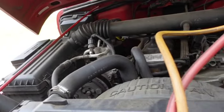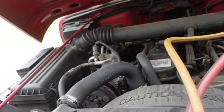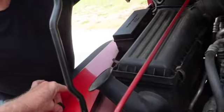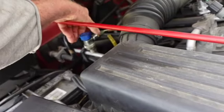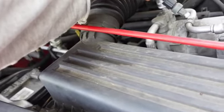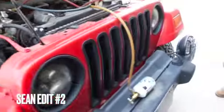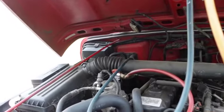I'm gonna make a cocktail of a little red devil sealant and a little bit of oil, inject it in there, and then put the Freon in. But we're gonna check the pressures first. Let's get these caps off. There's no use cranking it because it ain't coming on anyway. Let's just see if we got anything in there - never overtighten these. You got nothing. Maybe we ought to pull a vacuum on it since you've got nothing.